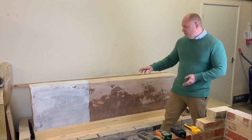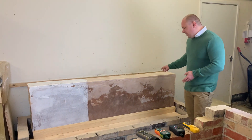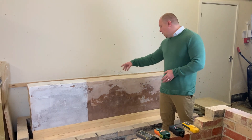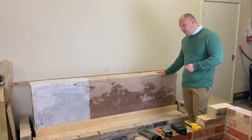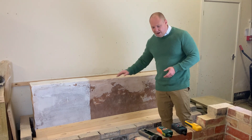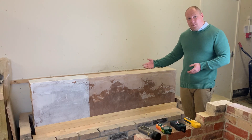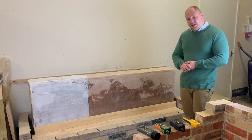You'll also see at one end we've painted it, and we will be painting various other sections with different types of paint as well. So this is a fairly standard emulsion; we'll be looking at something that's really high vapour permeable, and we'll be doing that on this end and comparing, while leaving a standard unpainted area. We'll be doing some gravimetrics on there as well, just so we've got a benchmark to test all these devices against.